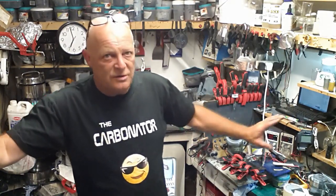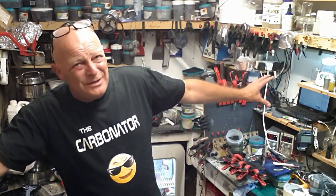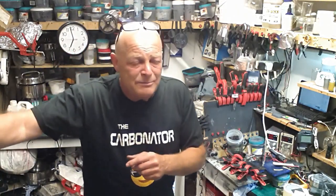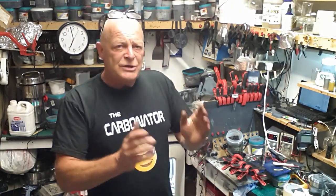Hoping that I get these results, like I said, of this charge. It hasn't got long to go. But the problem is the discharge. I'm discharging at 30 milliamps. Me and Tony have got this set routine now where we both do the same things, i.e. we're charging, discharging. I love the old 50 milliamps, don't I? You know, 60 milliamps, 80, 100, 150, my short circuit. But we've got to standardise a little bit now, where we discharge at 30 milliamps. The first charge is 15 minutes, and then the second charge could be 30, and then 40 minutes or an hour or whatever. So that's the way we're doing it.